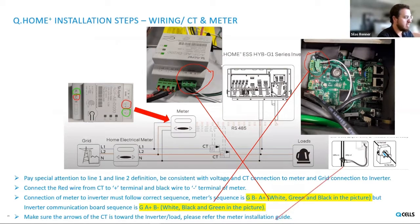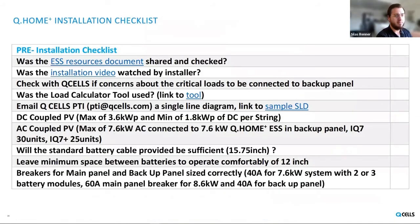The majority of inquiries fall into those two areas: wiring of the battery and BMS to the inverter — including the short connected plug, the data connection, and the dip switch on the BMS — making sure breakers are turned on and the button is turned on, and making sure the CT sensors are put on correctly. The challenge is that while this is the root cause in most cases, it's not always obvious when there's a problem — sometimes it'll just say BMS error. We have to go through the steps, look at the portal, and be on the phone with the installer to identify the issue.